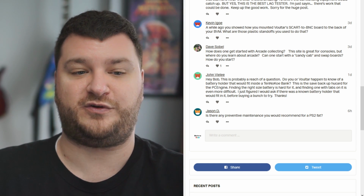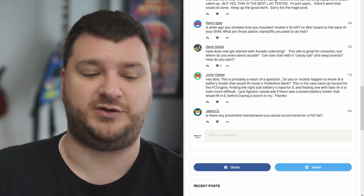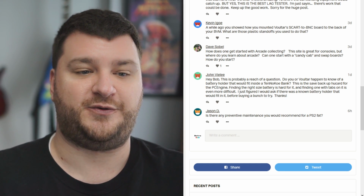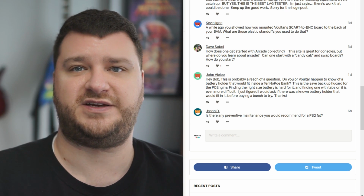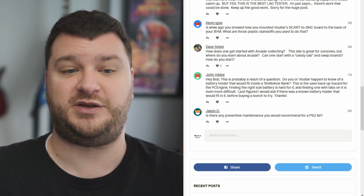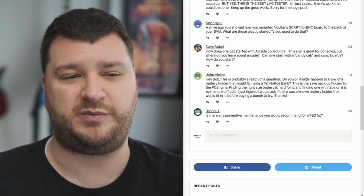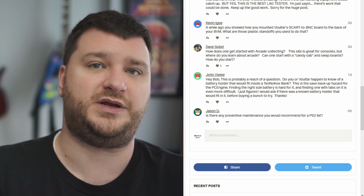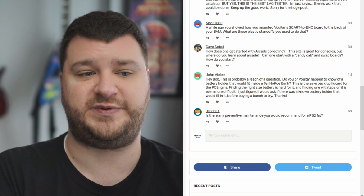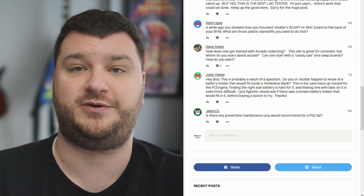But there is the one version of the FAT that Cousin Scott has now, actually, where when you disable composite video in Luma, and I have C-Sync going to both of those, component video still works. So I think it's one of the older versions of it. So if you have those, and you're comfortable working in such tight quarters, I would recommend doing that, just because all you would lose is composite or S-video. And if I remember correctly, you might even be able to leave S-video and just have composite like that. So yeah, those are really just my suggestions. But if I missed anything and somebody's a PS2 expert, please post down below.